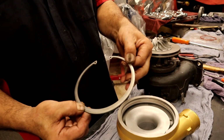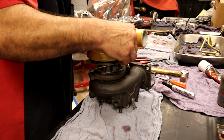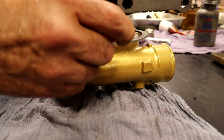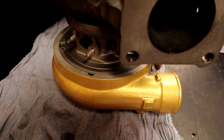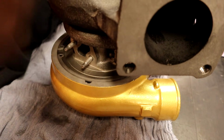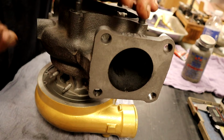Okay. You remember the snap ring has a taper. Yes. And the taper goes in and out. There we go. Pin line up. Flip it. We have to kind of slightly get a little bit of a gap in there. Yeah. To get it started. I have had to put it on the press before. Oh yeah, look at that. Did you feel that? Yep. And just put a little bit of tension, just like I did with my hand here. Yep. Just to help. And beautiful.